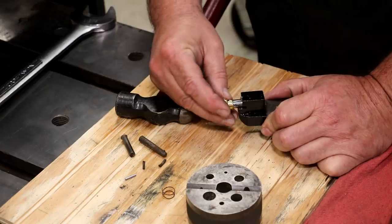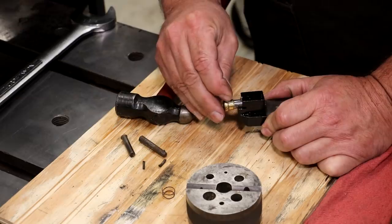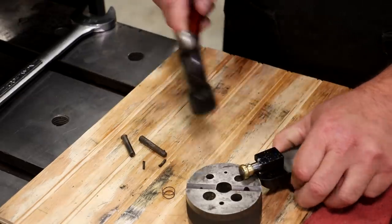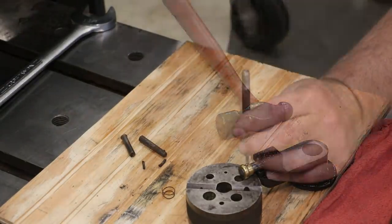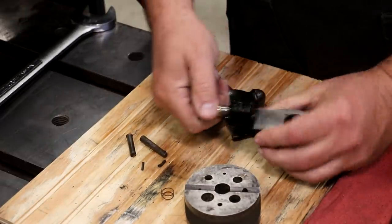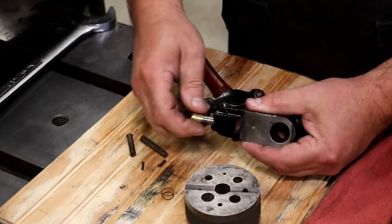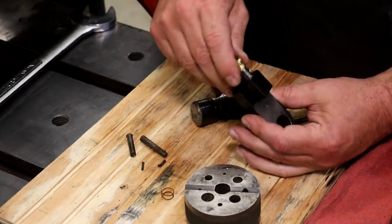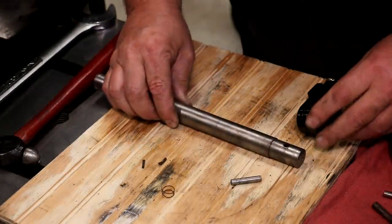There are a couple of holes up here in the top for pins. The old ones were all rusted up — I measured them and ordered some dowel pins the right size. This pin here allows it to either be in a forward, reverse, or pulled upward to disengage. I'll tap that in a little bit tighter with a bench block as a backer. That spring is a little bit on the light side — I may find one that's a little stronger, but for now I'm going to go ahead and reassemble this. There's a little brass button that goes up on top to give you something to hold it with, and a pin that goes in there.